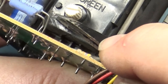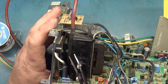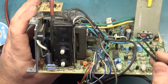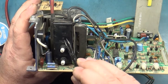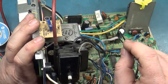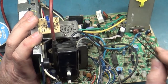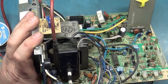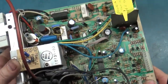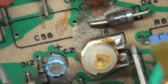Cracked from here all the way across to there — crack-a-mundo. It very well could be going into shutdown because of the flyback, but I want to do all the repairs first, then power it up. I'll do the repairs, test, and if we find nothing else wrong I want to power it up with this in there. If it still goes into shutdown, we'll test our shutdown pot. Sometimes it goes into shutdown so fast you can't check if it's set properly, so we'll use another working chassis to get readings.